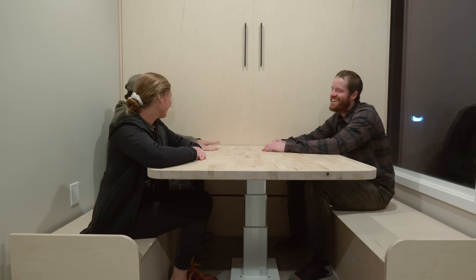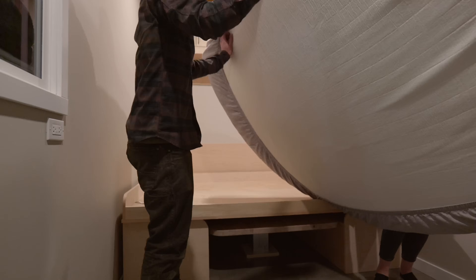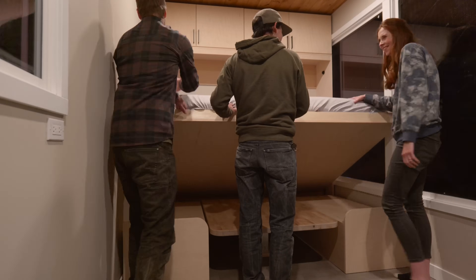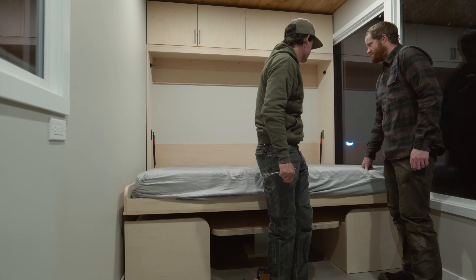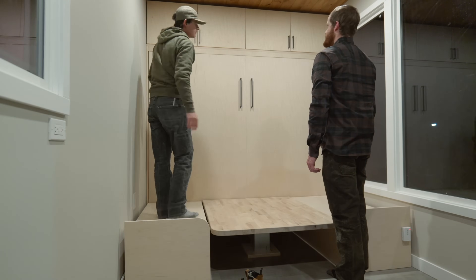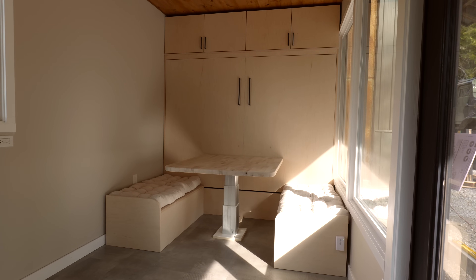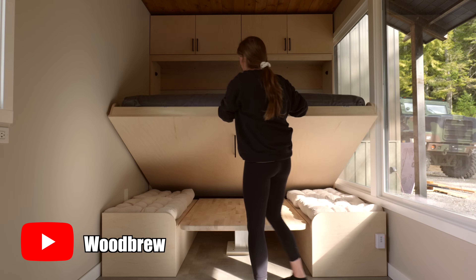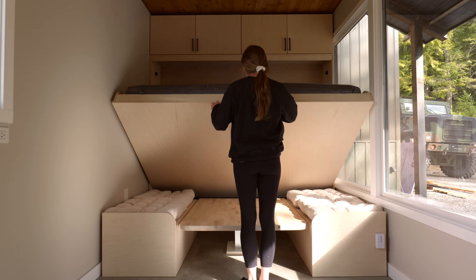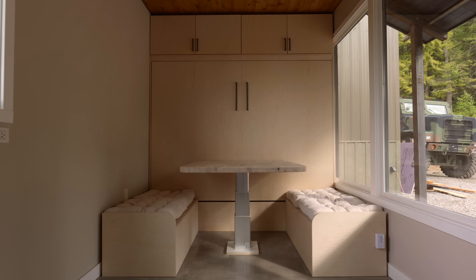Finally, the last step of the night was to install the mattress, because this is where Dylan and Molly are sleeping tonight. We folded down the platform and placed the mattress inside — we're all relieved that it fits perfectly. The gas struts were too strong for the weight of our mattress, so Dylan used a socket and threaded the adjuster bolts in to lessen the lifting power. Dylan and Molly started this weekend as complete strangers, but 72 hours later they're leaving as true friends. Their creativity and hard work helped make this build a reality. Make sure to head over to Woodbrew and check out their video. If you'd like to build your own version, we've put together a complete set of plans and parts list — link in the description below.